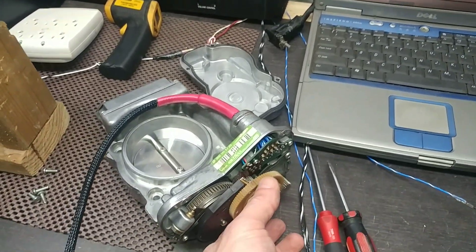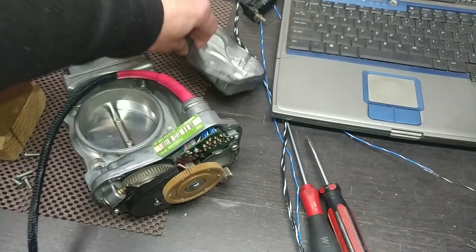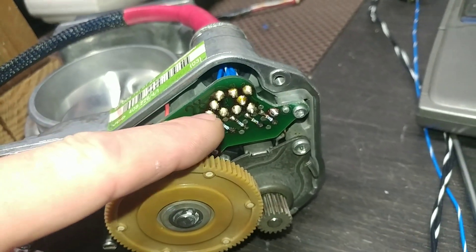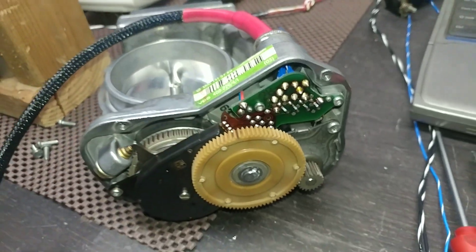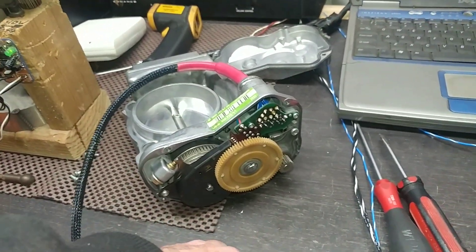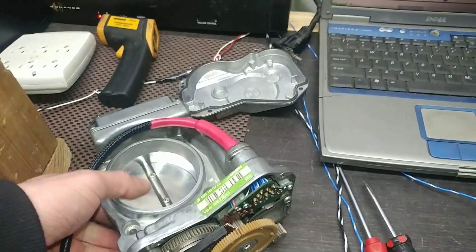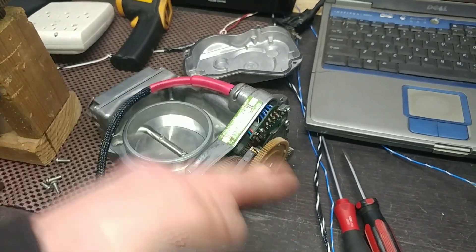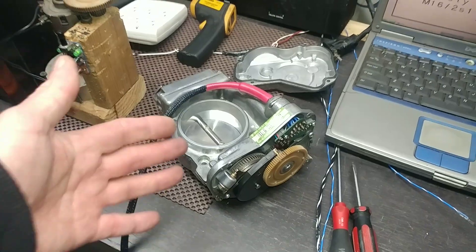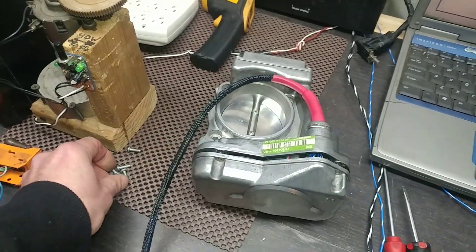It's a long video but I wanted to document everything before it goes back to Canada. The new wires are right there — you can see the soldering. That's flux, and there's nothing wrong with it. Many people say it looks dirty, but it's fine electrically. More flux is actually better because it protects the solder joint — it's like a clear coat, an extra protective layer.